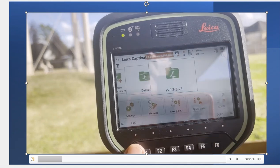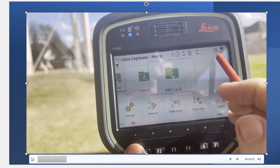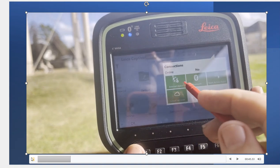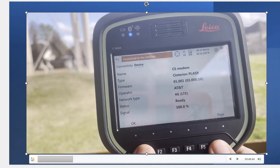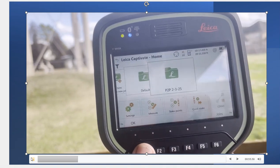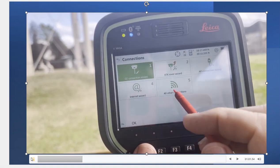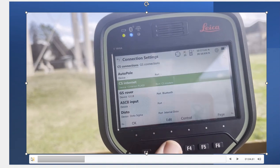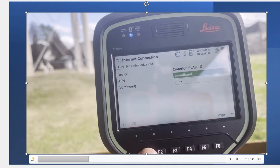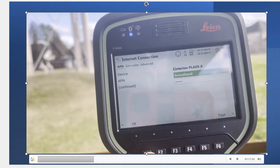Take a quick look at the settings. The Bluetooth light's going to come on and it should pair up with the nearby sensor. Right now we're not on the internet — we'll give it a second and then it should pair up over the internet. It's looking under Device — this is strictly an AT&T card, and after a few more minutes the signal bar level will come up. Under Settings, Connections, all connections, CS Internet, hit Edit — and it's turned on. Hit Control for the APN. In this case I'm using 'broadband' because I'm on AT&T. If you're using a DAC card, use a capital D-A-C.